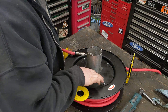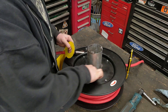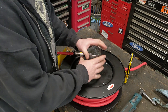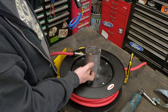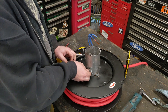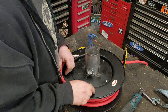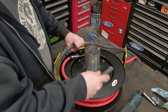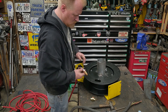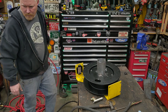Got that all welded on and bolted back down with the four bolts plus the one bolt in the middle. The material is paper thin but it's just a protection layer — it feels secure with no real force acting on it. The hole I made is the same size as a wire clamp, so that will mount in the side. I positioned it where the wire would bend most naturally. We take off the sleeve, remove the air hose, and push the wire up through.